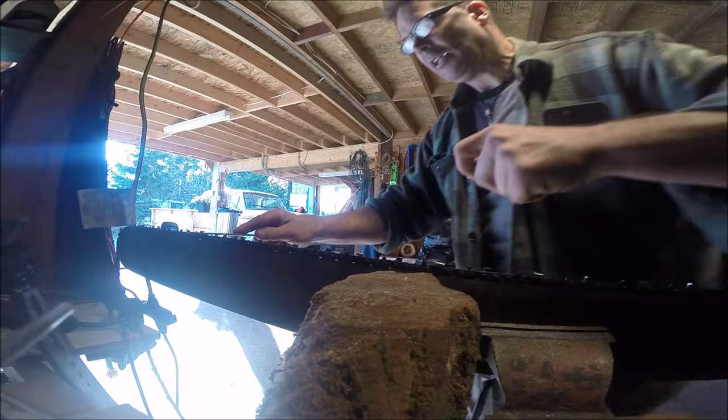You can't be really hungry, guys and gals. I mean you can in small wood and with little power saws, but in big wood, yeah — you're slowing your power saw down. You may think you're cutting faster and you are in small wood, no doubt about it. But if you've got a really hungry chain, it's not the safest. Anyway, I'm just taking a couple hits off these rakers — not cracking them right down. I filed this pretty good already.